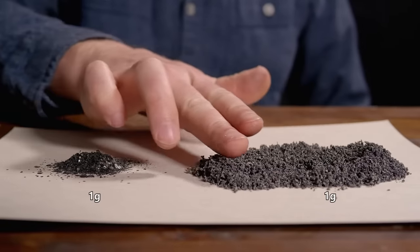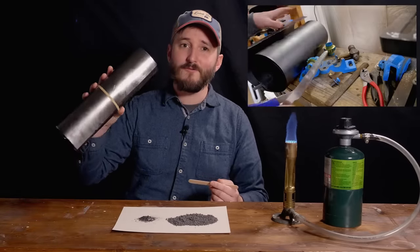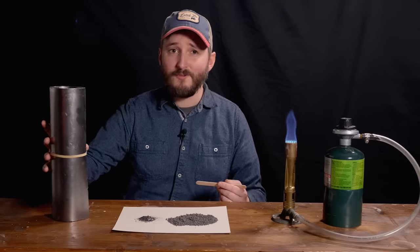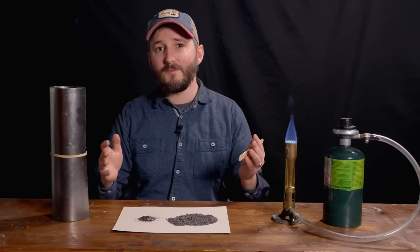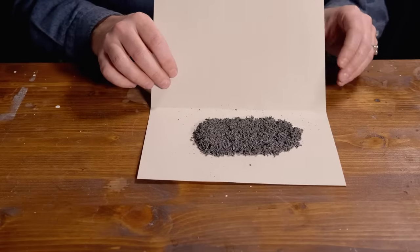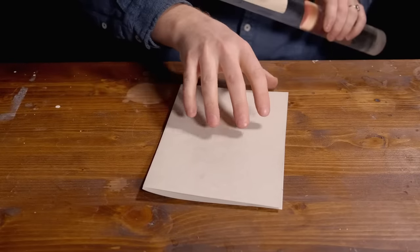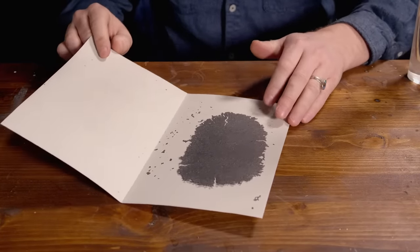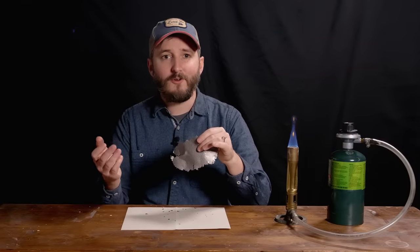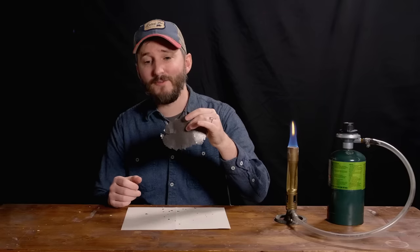So what can we use this for? In a previous video, I assembled a very poorly made rope machine, and to lubricate a few of the gears, I cut strips off a roll of graphite foil to line the cast iron channels the gears were set in. I've since learned that this foil is made from graphite that has first been expanded just like this, and then recompressed between rollers or plates to turn it into a foil. As simple as that, we can easily do the same by folding this expanded graphite between a piece of paper and crushing it down in a vise, or even by hand. The accordion shapes of the inflated graphite interlock with those around them and hold together tightly once compressed. The resulting foil is electrically and thermally conductive, lubricating, and chemically resistant. Foils like this are useful as electrodes in batteries, corrosion-resistant anodes for electrolysis, and high-temperature gaskets, among many other things — quite a useful material for being easily made right here on my workbench.